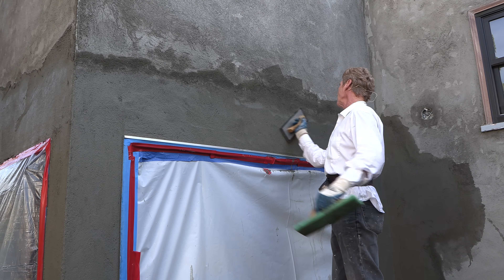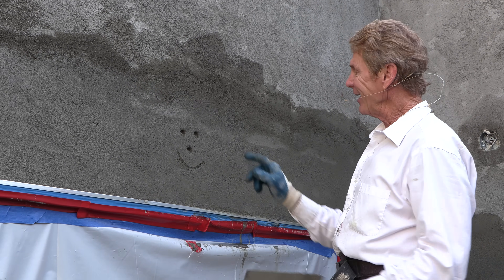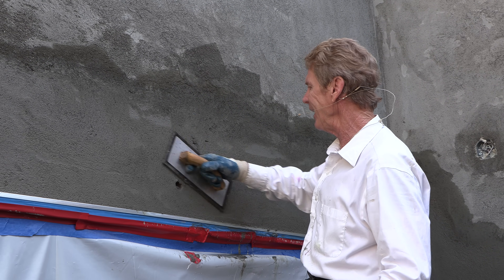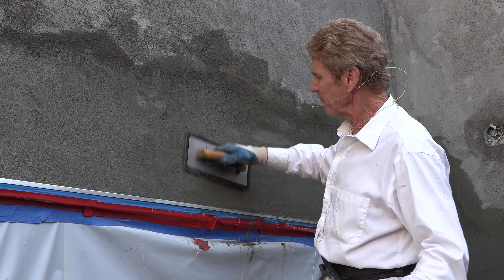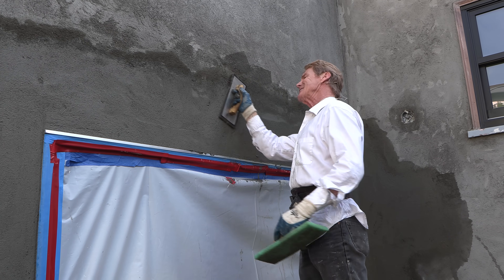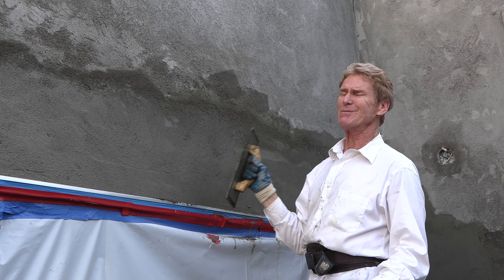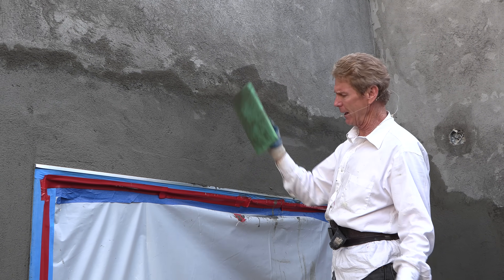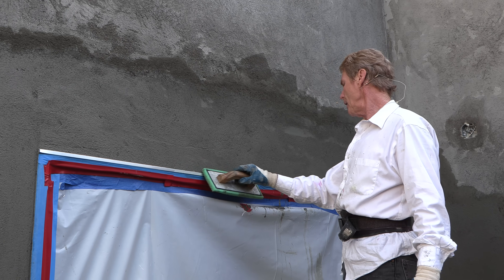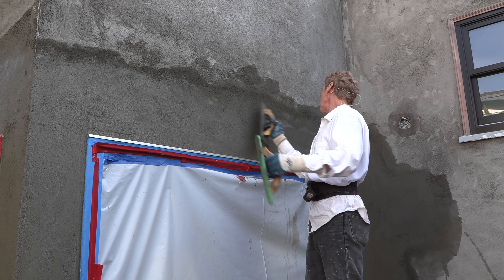The higher I go up, the harder it gets. What you want to do is bring the new mud into the existing hard material — a lot of elbow grease here. You don't want to go too soft; put a lot of muscle in there and get it up under there, otherwise when it dries you get a big perimeter crack. This last bit is just to clean it up and make it pretty so the owners know you know what you're doing. We've got to get back on the front — we're burning daylight.